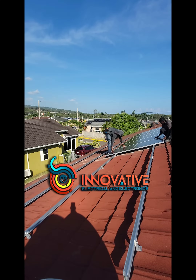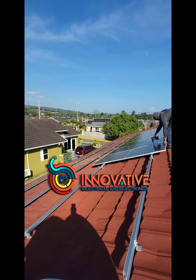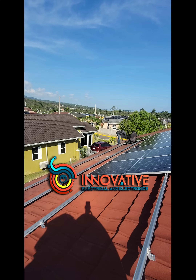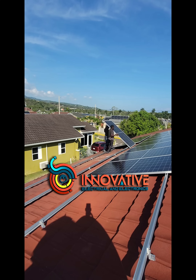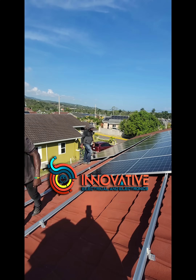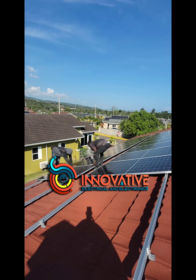As I've said before in previous videos, this part of the job is a little bit more tedious as we are exposed to the sun, but all in all a setup like this of 16 panels takes about an hour and a half, give or take. We ensure that all the footings screwed to the customer's roof have a silicone base, which makes sure we do not have leaks at the end.